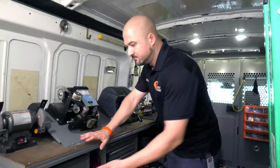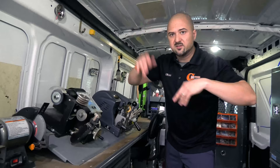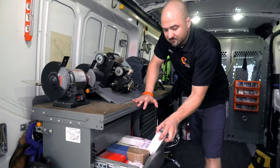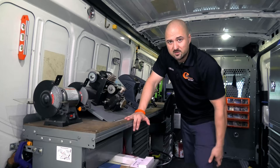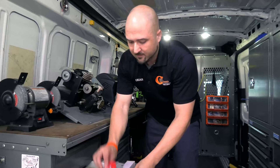Now let's talk about what's in these drawers. In here there are J-hooks and things for running wire for camera systems — all the different types of hooks to keep wire suspended off ceiling tiles. You'll also need stock: push paddles, mortise bodies, deadbolt bodies, a lot of things for storefront glass doors, as well as standard things like buzzing-in systems and Seco alarm receivers and remotes.